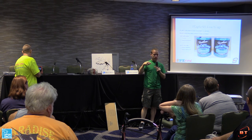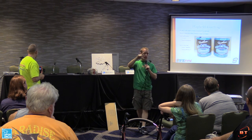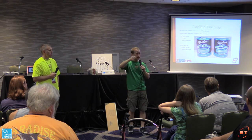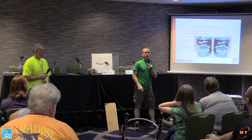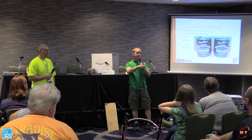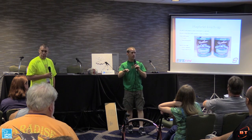So what I'll do is once I make my mix, I'll have an empty piece of Plex, just a blank piece, and I'll paint it on there, and I'll take a hair dryer and dry it, and then I'll take that back over to the machine and lay it on the machine in good light and see if it matches. And if it matches, I know I'm good, and if I need to adjust it, I can adjust it.